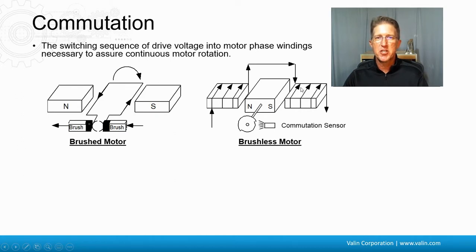If we look at a brushless motor, there's a commutation sensor here — you can see where it would be off here and on here. Therefore, it knows which way to change the current to match where the north is. So as it goes around, it's going to change current so it can attract the right pole of the magnet.